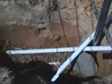And we've got a bunch of stuff here, twigs and pipes and stuff, to kind of brace it while the glue sets. So what I'm going to do is we're going to wait about an hour, and then we're going to put some pressure in this line and make sure the whole thing works without leaking before we actually bury it, because you don't want to have a slow leak underground. That would be really ugly and all that jazz.